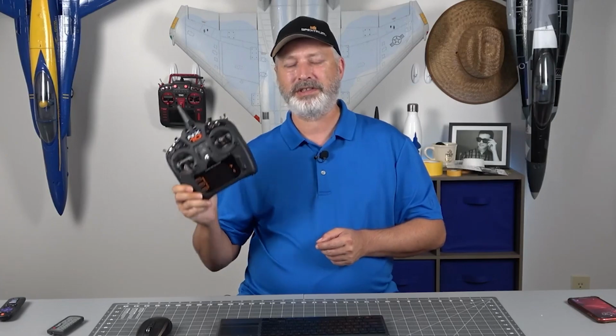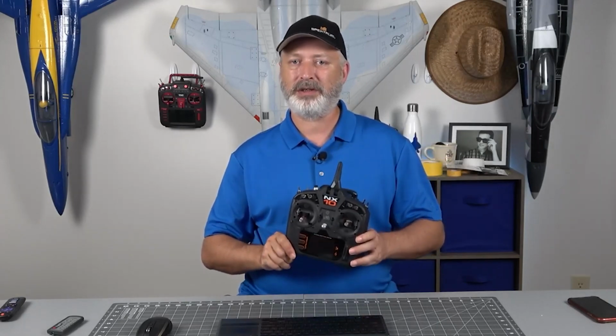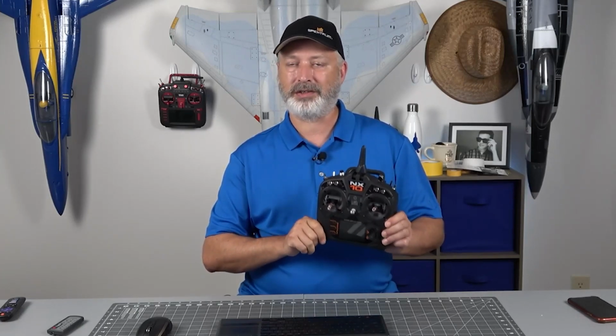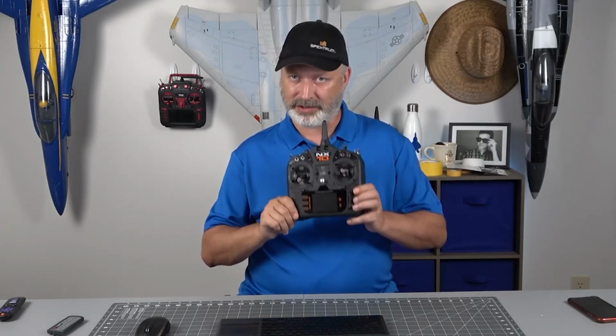Alright, all that aside, now that our plan is made, it's time to execute that plan in the transmitter. We're going to be performing all of these steps on the NX10, but this will apply to the NX series, Gen 2 DX series transmitters, and the IX series transmitters. In this particular case, we're going to be setting up an E-flite Viper 90mm with safe select on channel 7 or AUX 2 and thrust reversing on channel 8 or AUX 3. Now as a baseline, I assume you've already followed the procedure in the airplane manual and set up the transmitter in accordance with the computerized transmitter setup table available in all bind and fly aircraft manuals, and that the model that you set up is selected in your transmitter. Now let's jump into the NX10 and get programming.